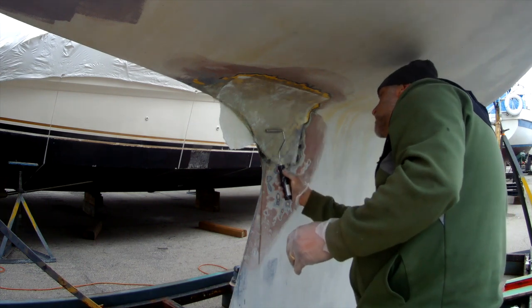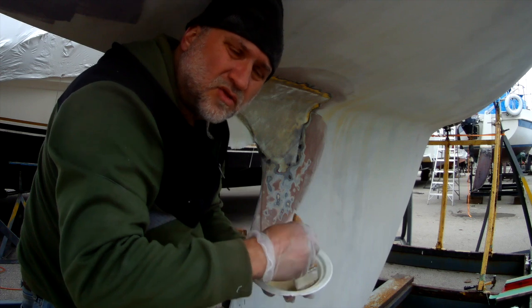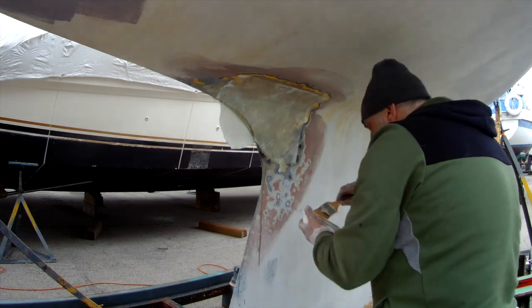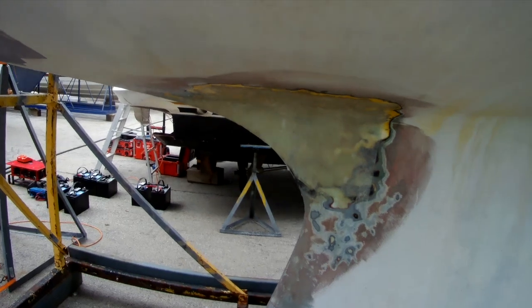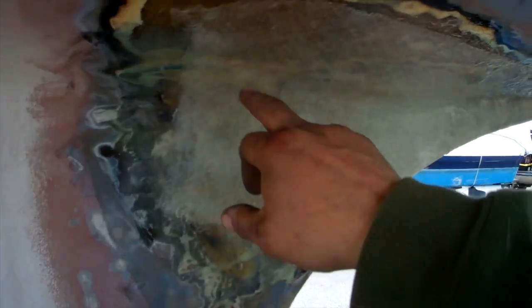Sand down to the edges, then put a little bit of thickened epoxy on it. You don't want it on too thick, but it shouldn't have white spots — white spots mean there's a little bit of air in there, so there are a couple spots where I didn't put enough in. The repair here is looking good. It's good that it's see-through — I can see in behind, which means I don't have any air. It's translucent all the way through and I can see the underside, so it's in good shape.